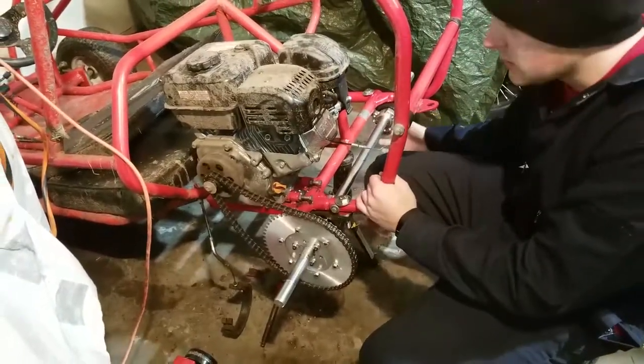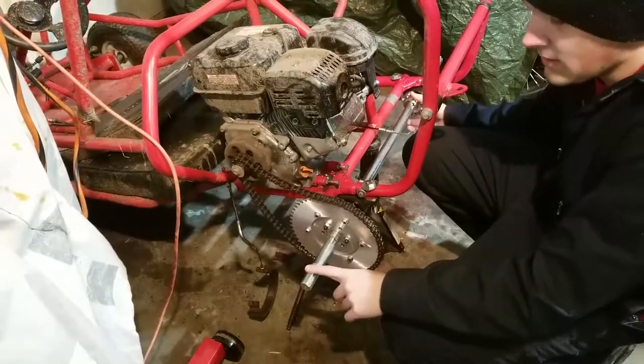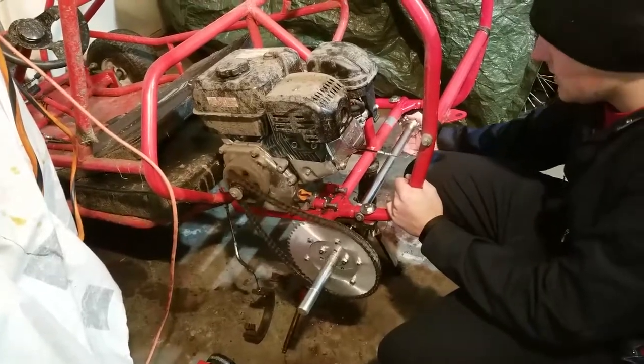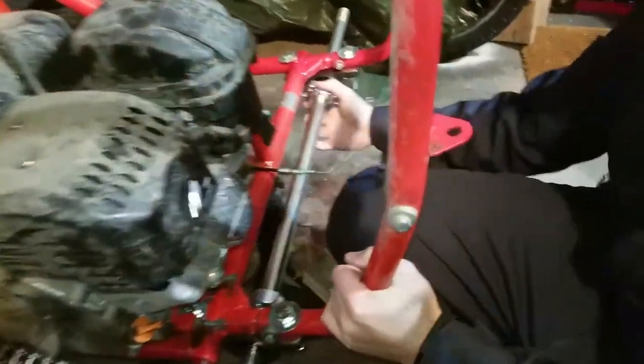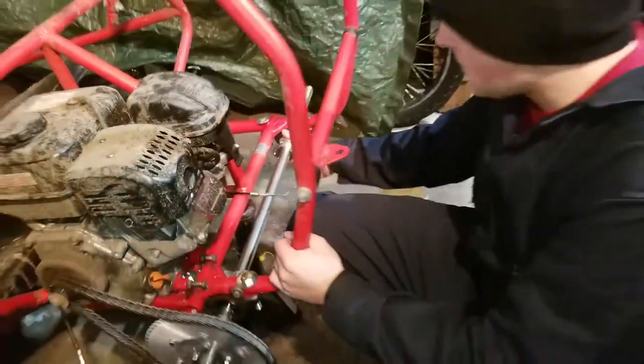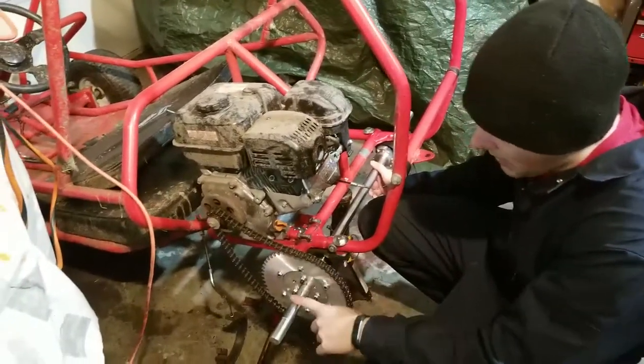We used the extra hubs because we're using non-race hub wheels. Just going to mount to the 1-inch axle. We use these extra hubs to hold to the middle here, so that when the axle slides back and forth, these things take the thrust force on the bearings here, so we don't have to worry about it. So those will hold the axle in place, and then this will put power to it.